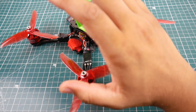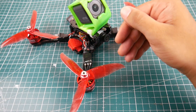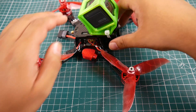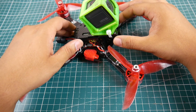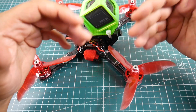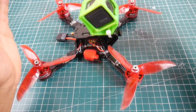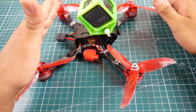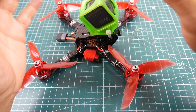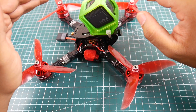These ESCs performed as tested — absolutely spectacular, no noise, absolutely phenomenal. And even if there was a slight bit of noise, we wouldn't even see it anyway. For the flight controller, I used the DALRC F405 all-in-one flight controller. I've done a lot of bench testing on this — it performed very well. It has a proper 9-volt regulator on board, which keeps the overall system absolutely clean. It performed as expected in the air — no weird issues, no jitters. Clean video feed, just as you'd expect from a flight controller with a 9-volt regulator. And I didn't have any low ESR capacitors on board, which was awesome.